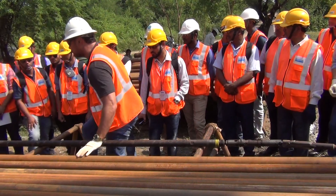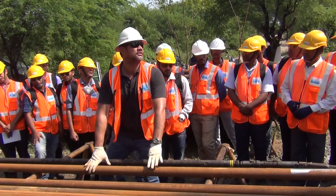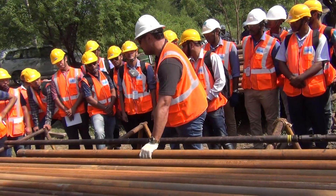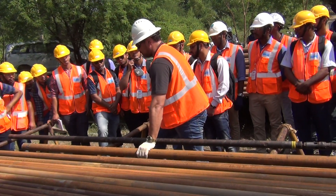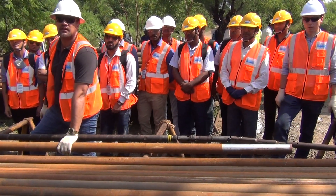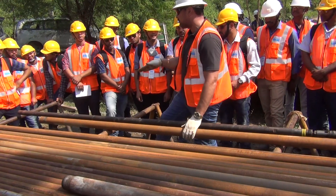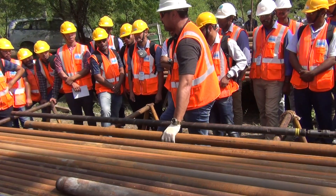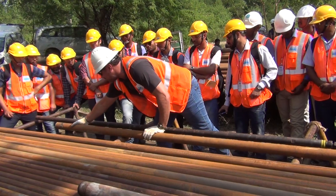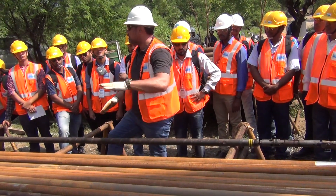What is the function of the chrome? It's to reduce damage — while holding with a pipe wrench or something, no damage should happen to the barrel. We also have flexi barrels, which have chrome on the ends and taper off — they're thin in the middle so you can get a bit of flex when you're drilling. If you want to deviate the hole, you can do it that way.